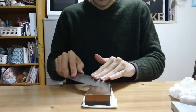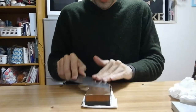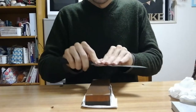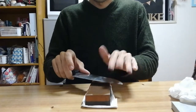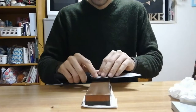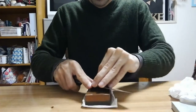That might take a while if it's your first time sharpening. But once you have that — once you feel a little bit of metal turned up, curled back — then switch to the other side, find the same angle, and go at it.